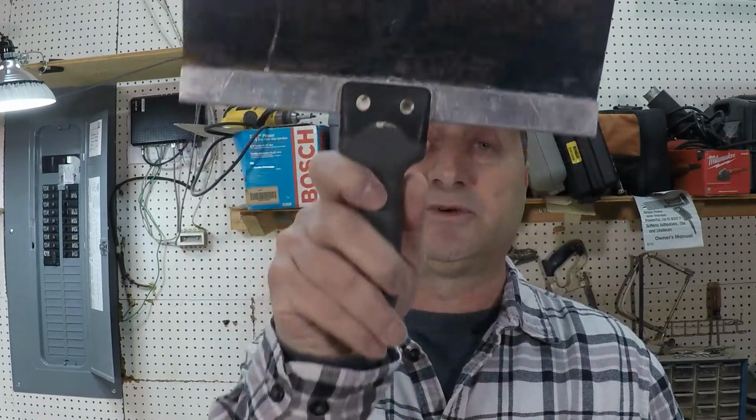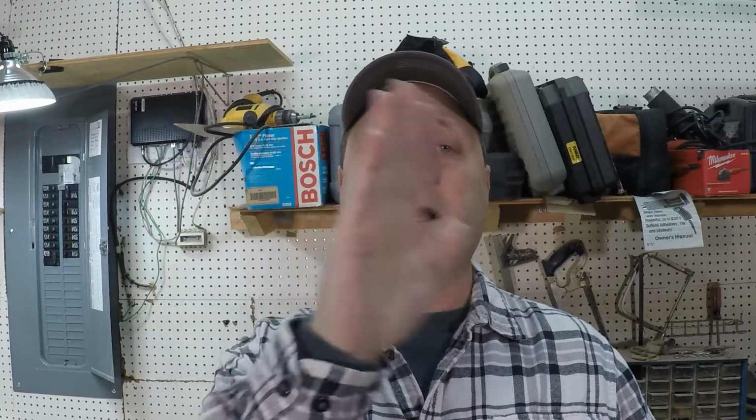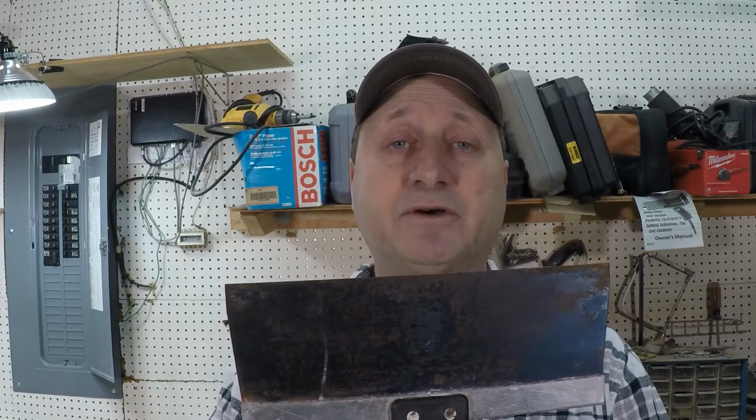The next one I have is a 10-inch tape knife. So after you've gotten your tape done and you've got your first layer of mud up to 6 inches, like you've seen on the prior knife, you're going to then want to fan this out even more, and you'll go with a 10-inch knife to apply a thicker, wider layer of your drywall mud to make it more even and spread out, so you're not going to see any kind of a depression in the wall, especially when you're using tapered drywall edges. You're going to want to now spread this out farther, so you've got a 10-inch knife to go next.